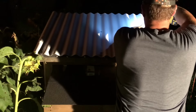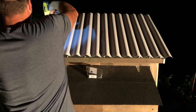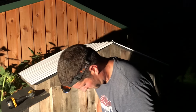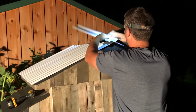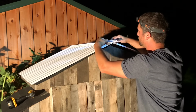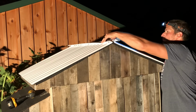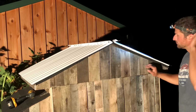The back is adhesive, and so it lays down like a shingle, but then it's flexible too. So I used that over 5 years of having my old coop. We ended up moving, which is why I'm building this one now. But yeah, in the 5 years that I had the other coop, that water and ice barrier, the black, shingle looking stuff, never failed. It never ripped or cracked or anything, so I feel real good about that.